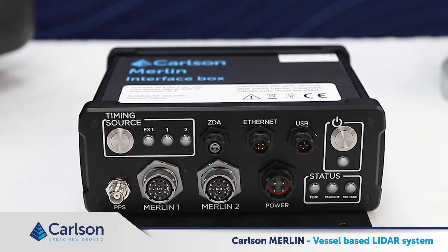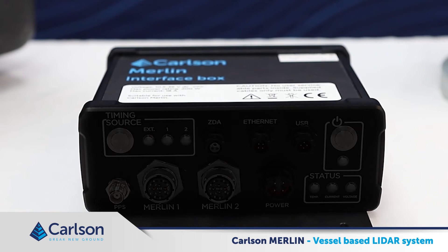As this is the front panel, when mounting take account of the fact that you will need good access to this side of the box, as this is where all the cables are interfaced, and you will need to ensure at least 40 centimeters of space for cables to bend and run into the appropriate connector. For the laser data to be useful, it needs to be time stamped. The timing source button allows you to select where the timing information originates. Press the button to scroll through the options which will be indicated by the LEDs. If all three LEDs are off, the Merlin is using its own GNSS receiver to produce its own time tags.